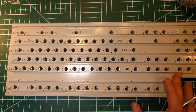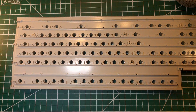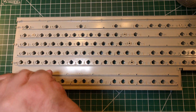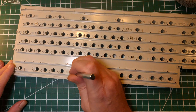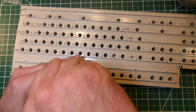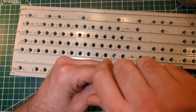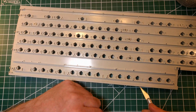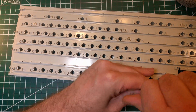Now we have dots in all the right places. We can just make some pilot holes. For this I've just been using an exacto knife - helps if it's pretty sharp. It also helps that when you put the mark on where you want to put the bolt, you be careful about it and try to put it mostly in the center of the rivet post that you cut off. That way you just put your knife in there and twist it around on the dot. If you don't mark the middle of where the post used to be, you have to do the translation in your head. Just do all of them, keep going around.